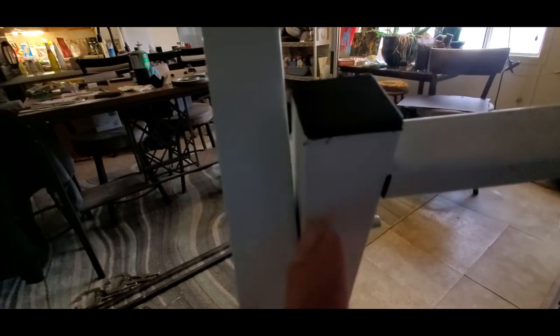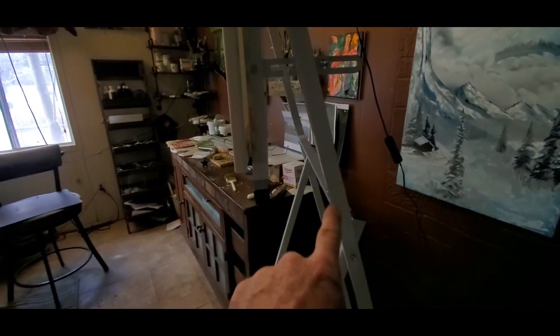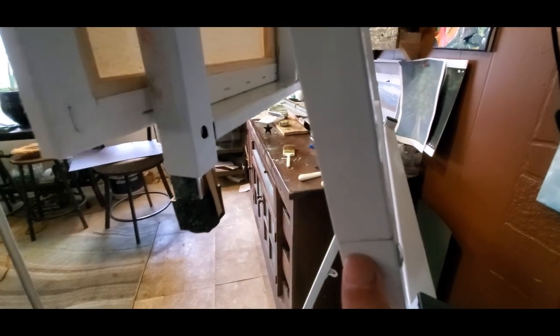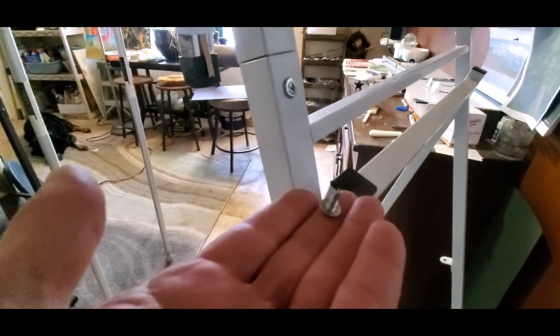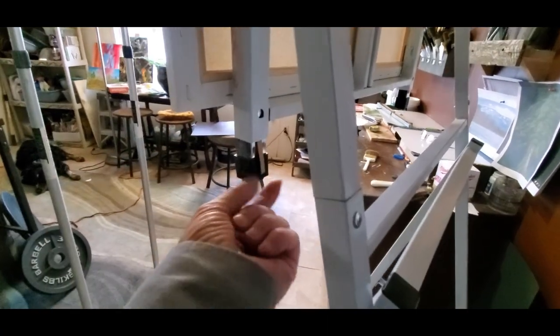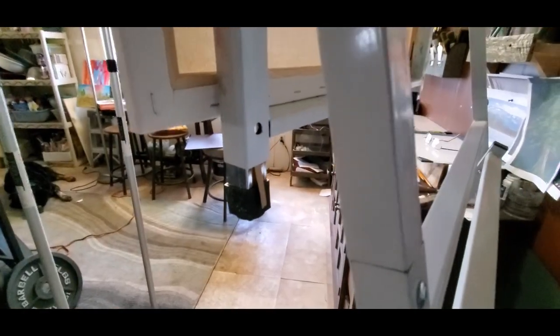You will not get it tight enough to take the gaps out that happen in between. The top piece has a telescoping leg that will insert into the bottom, and that joint between the two will remain loose unless you screw it together. I used a self-drilling tech screw, flat head. And these bottom legs — these little legs — rattle. I've already got shims driven up in there to take that problem out. Shim it or tape it to keep it from rattling.